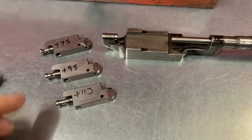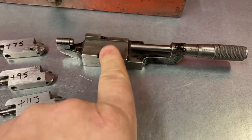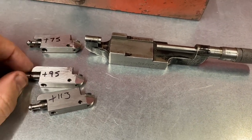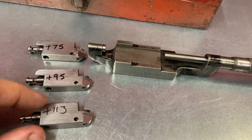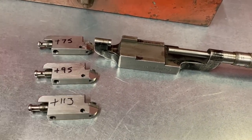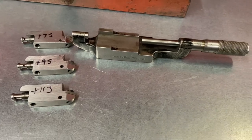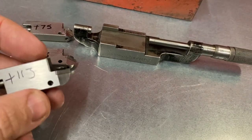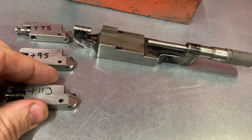The first thing I need to do before we even get the machine ready is to get the cutting cartridges set. I've used the setting tool and set the sizes — the block is already 60 over, so the first cut is to go to 75, then 95, and then we finish up at plus 113. I set the cutters so I can just set the offset, put the cutter in, do a bore, take it off, move for the next offset, put the next cutter in, et cetera. I use the Beam Equipment carbide insert modified cutting cartridges with an indexable insert on the end — that makes life a lot easier and quicker.